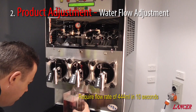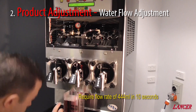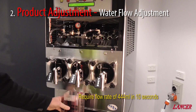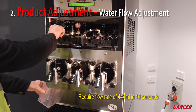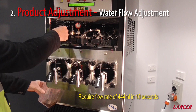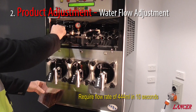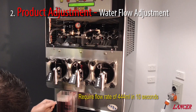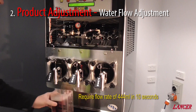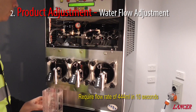On one side of this measuring cylinder it shows 15 ounces, and on the other side it shows 444 mils. With one test done, we should check it again to make sure that we have the correct flow rate. Again, we will look for another sample with 15 ounces or 444 mils in 10 seconds. With our second water flow rate sample collected and it being a consistent 444 mils in 10 seconds, we can now move on to brixing our product.